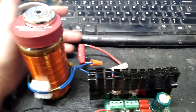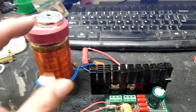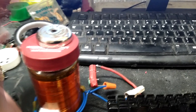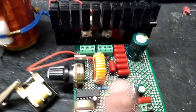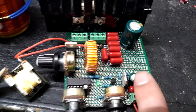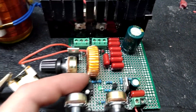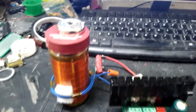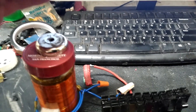What was really awesome was when I bumped down to a 25 nanofarad tank cap and played with the coupling a little, I could actually get this thing to run down to — I think it was about six volts — and still get interrupted output. The arcs were still like an inch long at only six volts. Problem is, when you go below six volts, after the drop from the regulator, it no longer powers the TL494, so you can't run it interrupted below six volts.